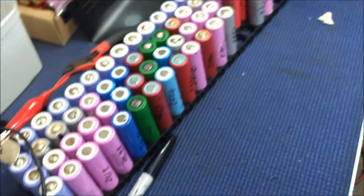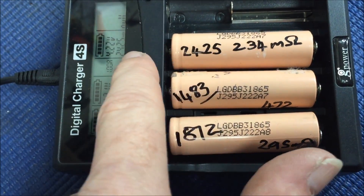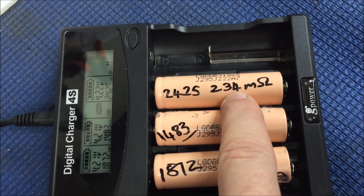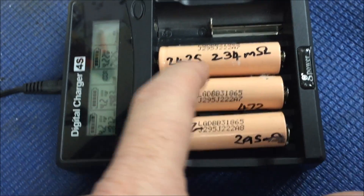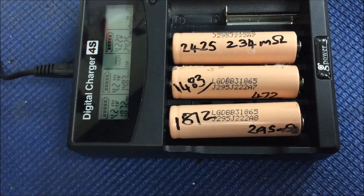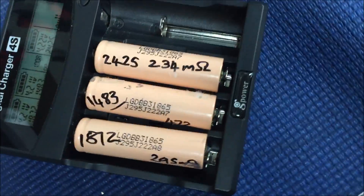These cells are no different — there's no consistency. But I'm really happy that I actually did test all of those cells. All of those cells are right. These cells here — that one's got 2425 milliamp hours, and I tested it twice; the second time it was 2410. That one has fairly high milliohm resistance and lower capacity. That was the one that was self-discharging, so I'm going to correlate that self-discharge with high resistance, possibly. Moving forward I'm just going to start testing every cell for resistance.